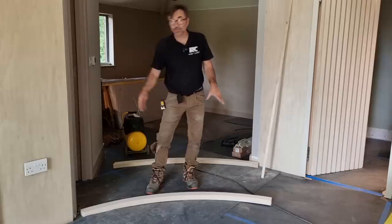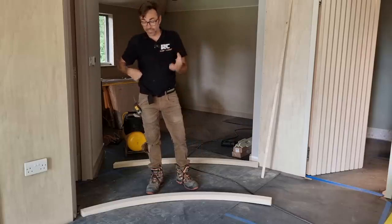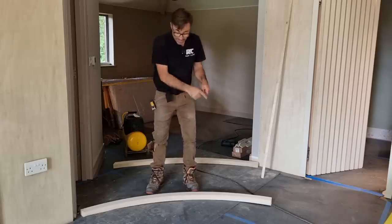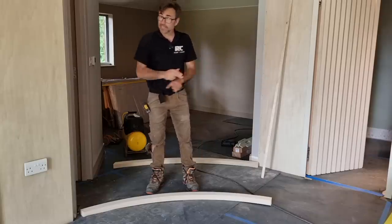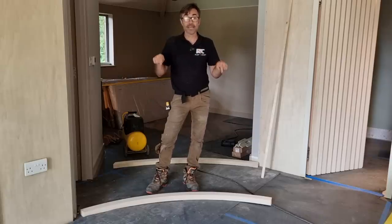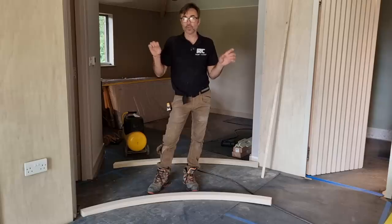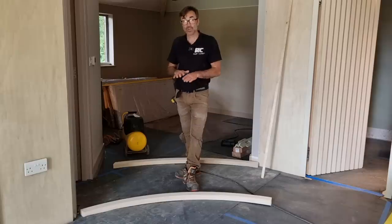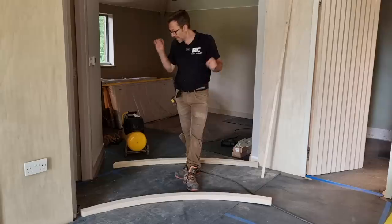All I need to do now is shoot them in and put together the actual screens. All we need is the ribs - the sections that join the slats front and back - and I'll fix those all through parallel, cut them all the same size. The floor is super flat; Southern Screed did this floor and it's absolutely perfect. I laid a clicked-together LVT floor on it - about eight millimetres with a micro tongue and groove - and when you haven't had to latex it, that's when you know you've got a flat floor.